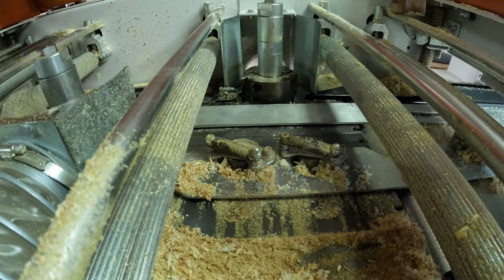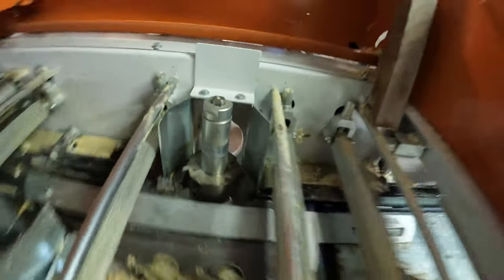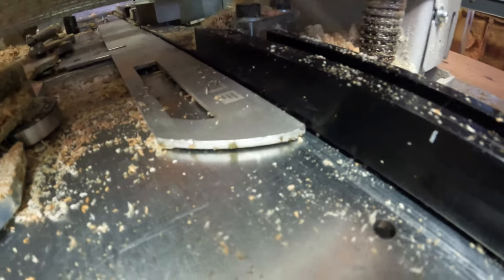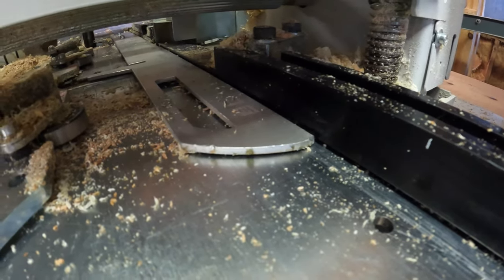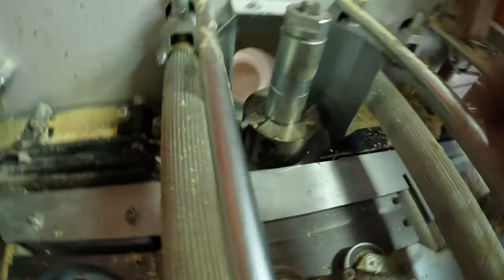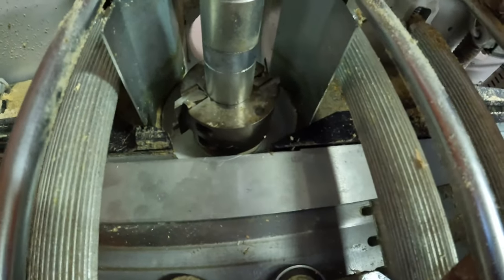That's set to where we want it for the cutter head we're using. The beauty of this MP360 is I just loosen my clamp and turn the lever until I bring that fence right up. I need to clean out some sawdust, but I bring that right up against the straight edge. My front fence is set — the two-millimeter cutout on the jig represents how much material will be taken off. If you want to take off more, just leave that fence back further for a heavier cut.